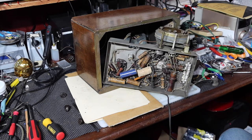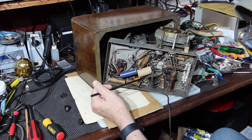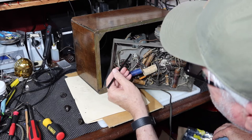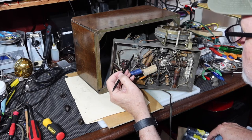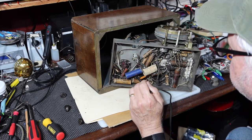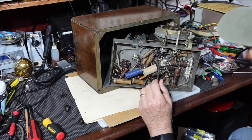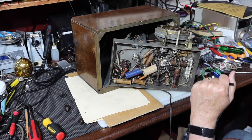So that bias cell is like a battery, and it just slips out of there. You used to be able to buy replacements of these and just pop them in. I was just talking about the battery going dead, and then my camera battery died! Anyway, this is where the bias cell is — it can be removed and popped out. They sold replacements in drugstores. I might be tempted to put a watch battery there or something. As for capacitors, it looks like this one's a replacement. This area looks a bit sweaty — I don't know when this was last run for any length of time.